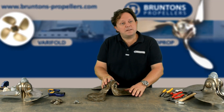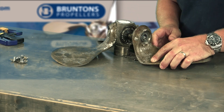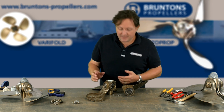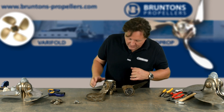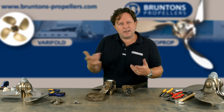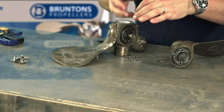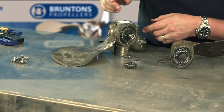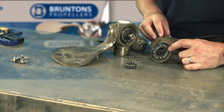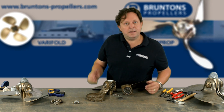There's nothing else holding the blades on now, so with a little wiggle the blades come apart. Normally I would do this on a vise in the workshop, holding everything level — I'm just showing you for the effect. You can see all the little ball bearings starting to drop out, so we'll count them and make sure they're all there; the rebuild kit usually includes a couple extra. On the hub you can see the taper roller bearing that's just dropped out, so we've got two sets of taper roller bearings and the ball bearings on two tracks.